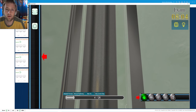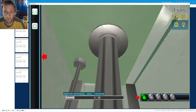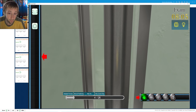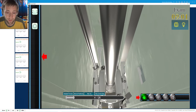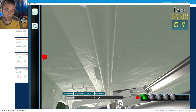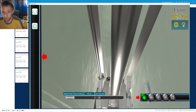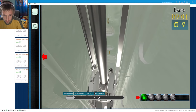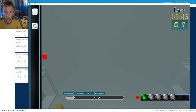We need to reach the stuffing box. First of all we need to turn our engine. The best and most safe way: when the crosshead is in position, one person goes and tightens with the safety belt from the piston rod around, and another person goes from the other side. The best case is that two persons go there for the disassembly of the stuffing box bolts.